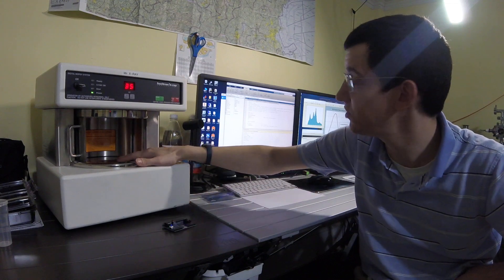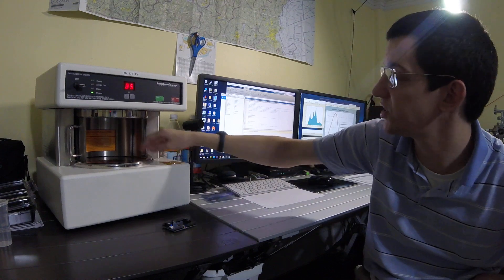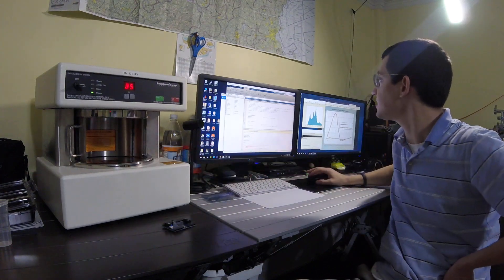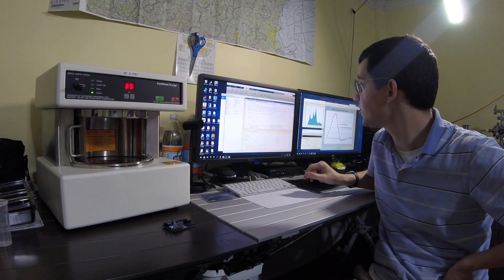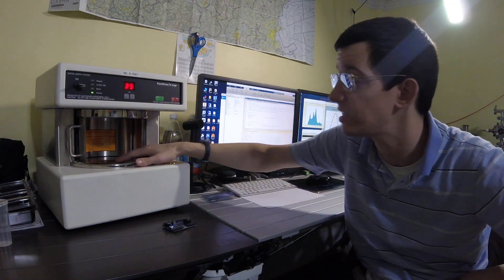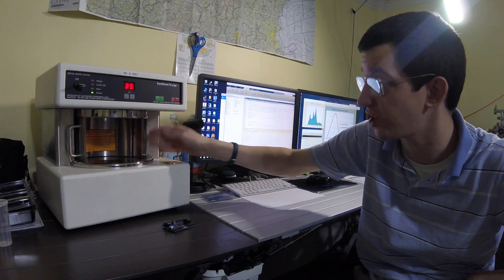In the bottom of this unit there's a Hamamatsu flat panel detector X-ray sensor. It uses direct deposition of cesium iodide onto either a CMOS or a CCD sensor. This one specifically is the Hamamatsu C9730DK-11, which is similar to the standard DK-10 stock model except the active area of the sensor is in a different physical location on the plate and the ports are on a different side.